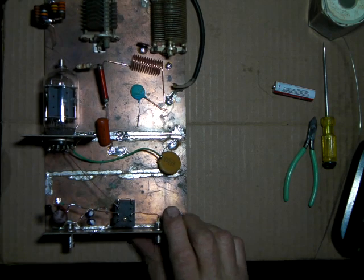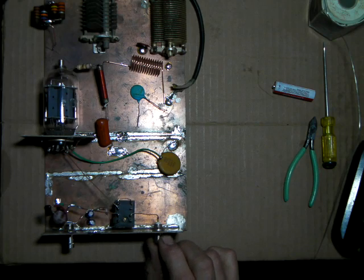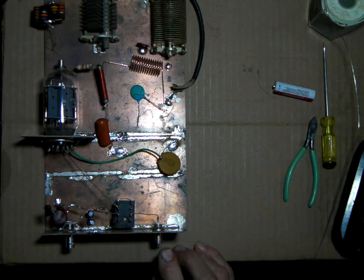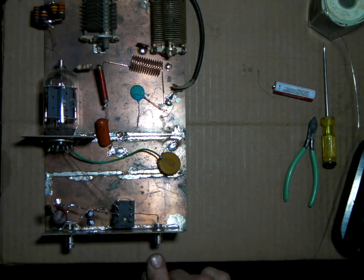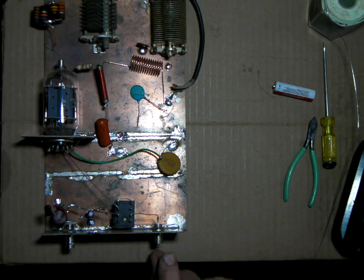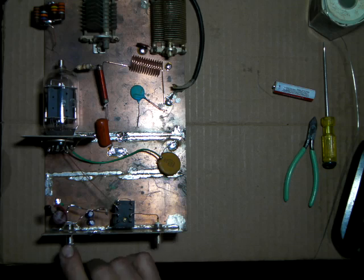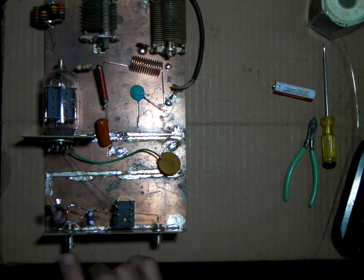On here, if you can see these little connectors, yes, they don't look like an SO239, and because they're not. I have a lot of what's called BNC cables. They're just a push quarter turn, they lock on, and it's just easy for me to use these because you drill a hole, feed them through, put a ring nut and a lock washer on it, and you're done. The larger ones have to mount with screws and got to punch a great big hole. For me, just changing around with this, since I'm experimenting, I just threw these in there. It's just easy, and then I have adapters that plug on from here and change this to a PL259 to go to my meter and my radio. So that's why these connectors look a little different, but they'll work. If you find them, you'll see that they're just easier to use if you get the cabling to go with them.